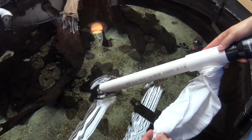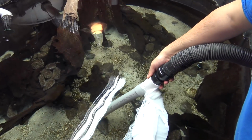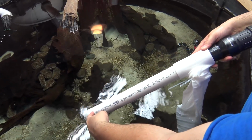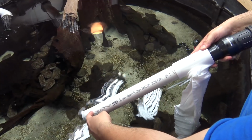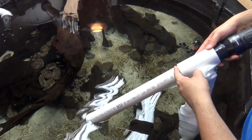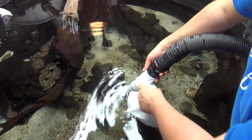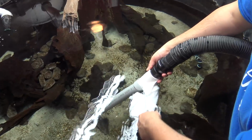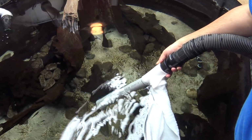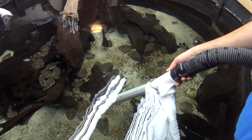It's sized to go into this 300 gallon stock tank. And as you can see, the important part is that the half inch pipe ends about here, which means hopefully all of that air that's getting blown through here is going to travel back up this 1.5 inch pipe. And then because this is sized so that the T exits right here at the water height, all of that debris should end up in this sock. So, let's give this a try, see how it works.